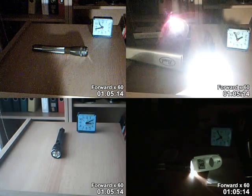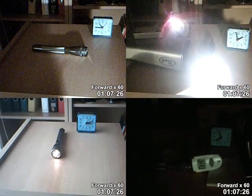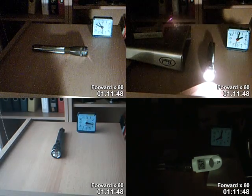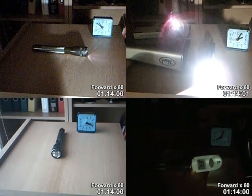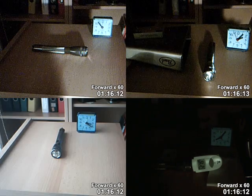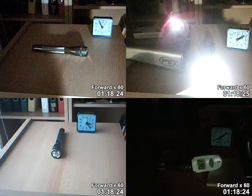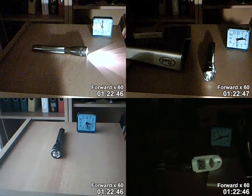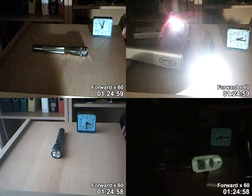After the contacts start closing again, it takes some time to make contact. Because if the surfaces have jumped apart, then the resulting gap needs to be closed again. And if the last contact point burned out, then a new contact point needs to be created by breaking the insulating layer. Finally, as contact is made, the cycle starts again.